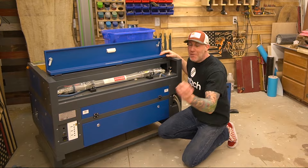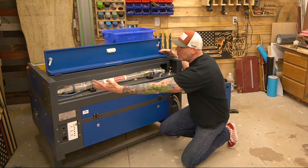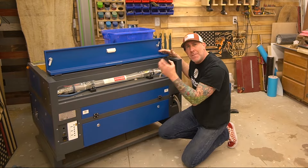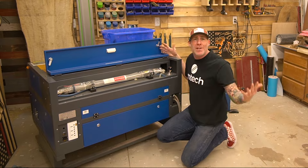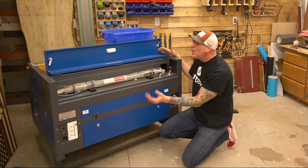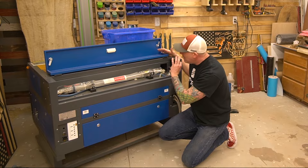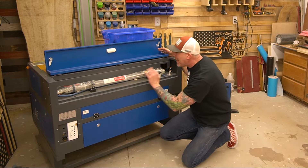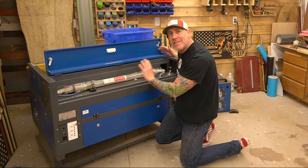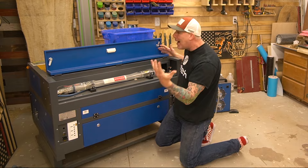Just in case you've never seen one, this right here is your CO2 laser tube. It's actually made out of glass and you will be running water through this laser tube to keep that laser beam nice and cool. So obviously this is one of the first things you want to check when this laser unit arrives. Go ahead and open that cover up — this is made out of glass, so if there's any issues, if this thing is shattered or has a major crack, you're going to know right away. Do a nice visual inspection and make sure you don't see anything that catches the eye.